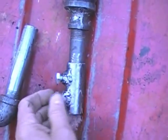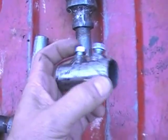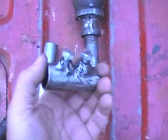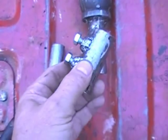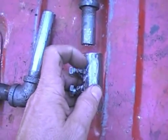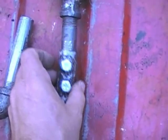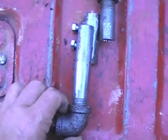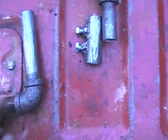This is the coupler — I reduced once and then welded a half-inch straight coupler to the bottom because I had three reducing couplers to get down to the proper size for my nozzle; I simplified by cutting out some pieces. What I made here is a slip sleeve — three-quarter inch plumbing pipe with the threaded ends cut off, filed out on the inside, slides right over the half-inch pipe. The slip sleeve slides up, allowing me to take the nozzle inside, slide it up and down to position it over the fire cone, then lock the two bolts in place.